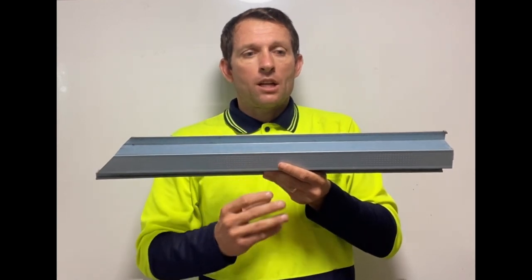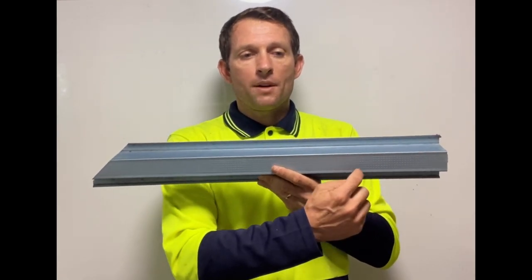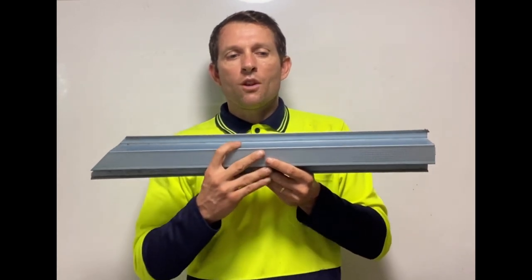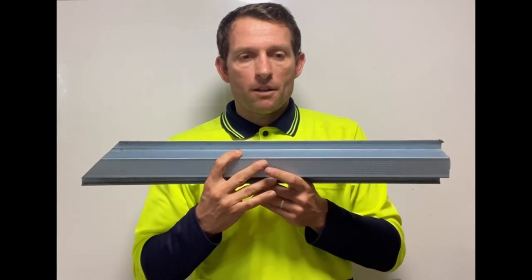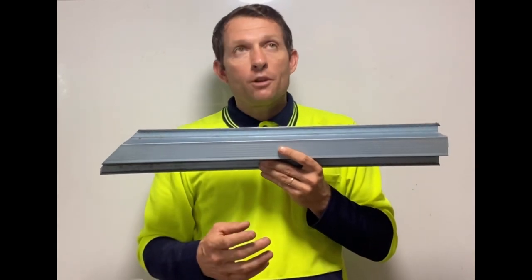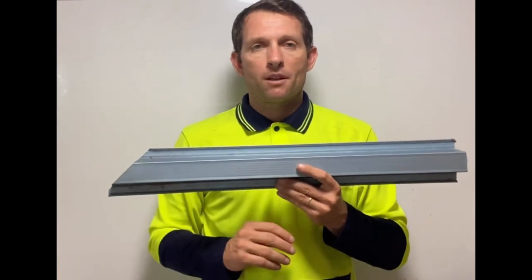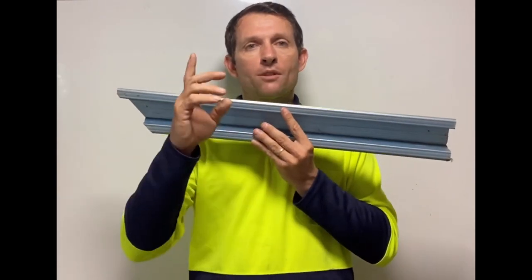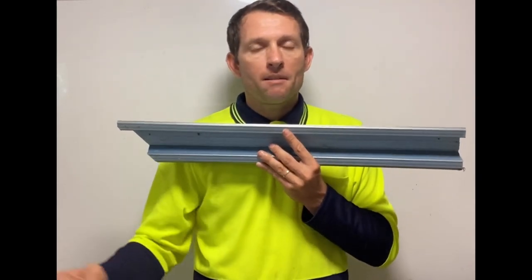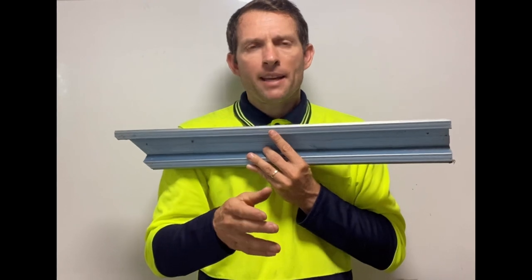It also says, in clause 4.2.1, that fixings should be in the center of the supporting member or batten. It also says there is a tolerance, and we know that because screw lines can be not straight, but fixings can still be relatively toward the center. So even when you're underneath a house, for example, a new construction or a renovation, and you can see underneath that metal battens are on, it's not unusual to get up on top of a roof, particularly if you're marking every third or fourth sheet and then flicking lines between when you're screwing off, and still hit the center of the batten, but get up on top and see a wavy line.